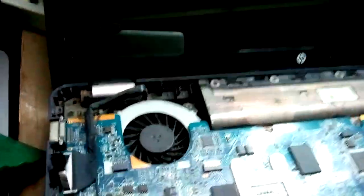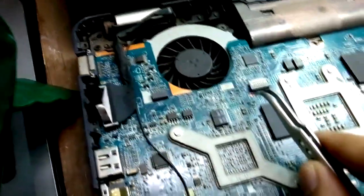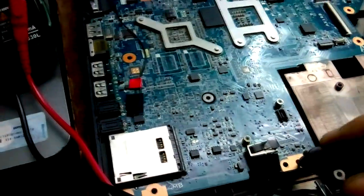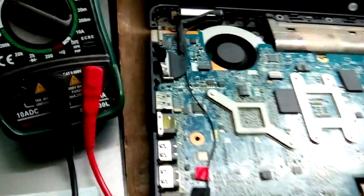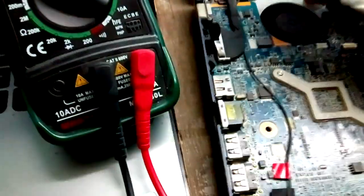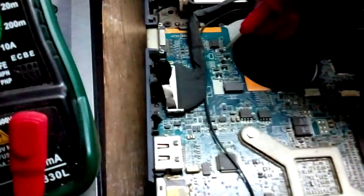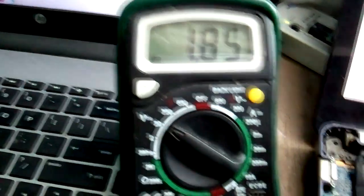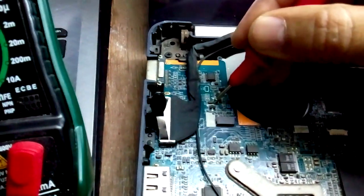The problem is it came here with a white display. So when I turn on this laptop, it gives a white display. I have to check what the problem is. I connect my ground here — usually it drops the 3.3V LVDS which is here. When I check on the LVDS connector, it gives me output 1.8V. So this is the problem causing this white display.